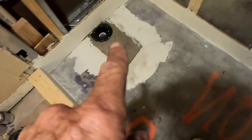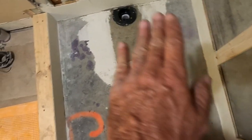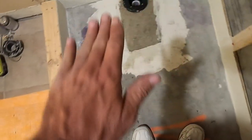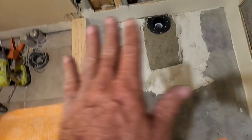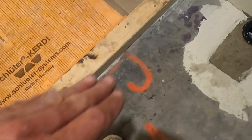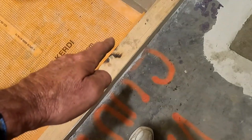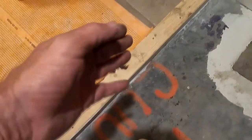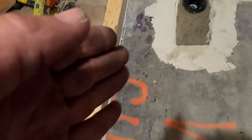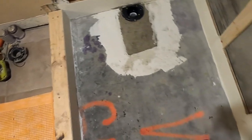The box was already filled in with concrete last night, and then a couple hours later I screeded out some thinset around there. It was slightly high, so I feathered out some thinset around there — not for any real reason other than I like that smoothness, because I'm putting KERDI on there and it's imperative that I have as smooth a surface as possible. The thinset got screeded onto the KERDI only on the inside — I didn't feel it was necessary on the top since I'll have thinset wrapping around there eventually. I'll probably red guard the outside just for good measure, and because I'm using GoBoard there's no problem putting the board into the pan — it won't wick up water.